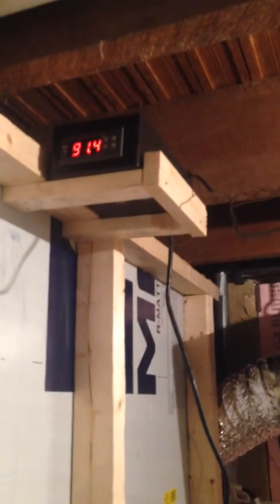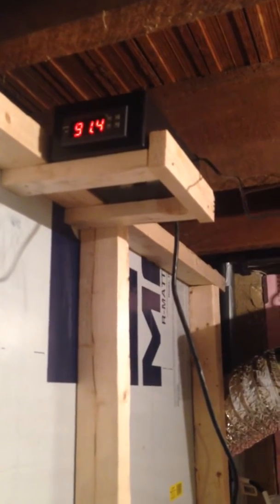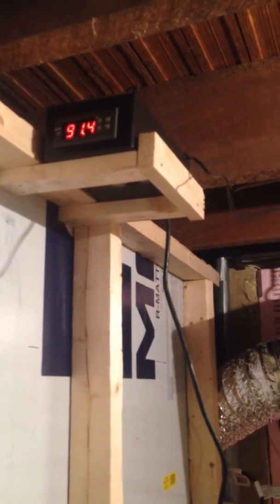There is the monitor for the humidity. There's a humidity probe and temperature probe on the inside to measure the humidity — that's temperature adjusted. The fans you just heard kick off. There's a filter box here that has a 140 CFM fan that pulls fresh air in.